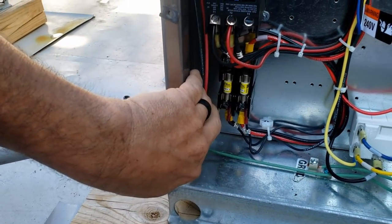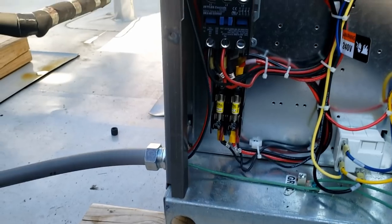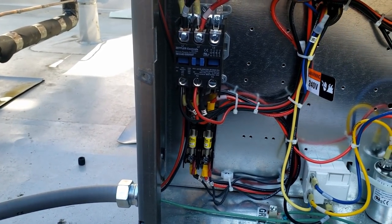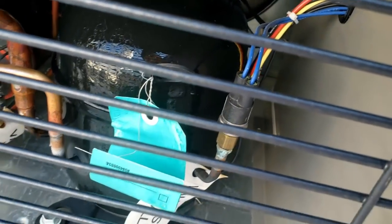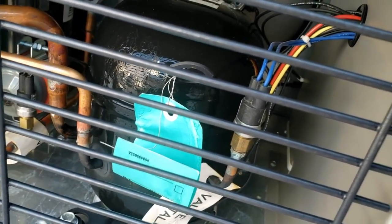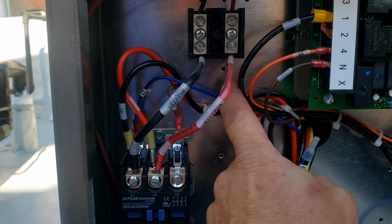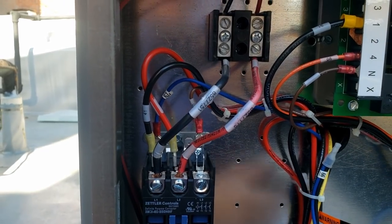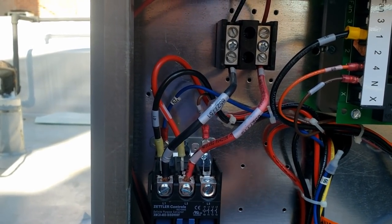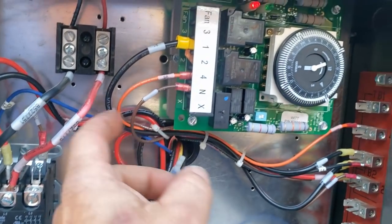Yeah, you can tell nothing's happening, because look, we got 2 power wires and a ground going downstairs. That's the only communications we got going on, so there's no communications up here at all. The pressure switch is probably just a generic little pressure switch, a little cheap screw-on style. So that blue one comes in to here, and it does break one of the leads on it, so that's the pressure switch. It shuts it down. So inside it's going to pump it down, valve it off at the electronic expansion valve, and pump down then shut off. This here, I'm not sure why.